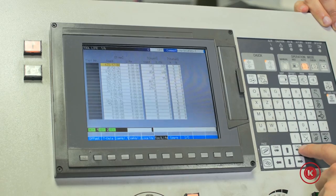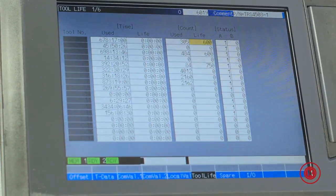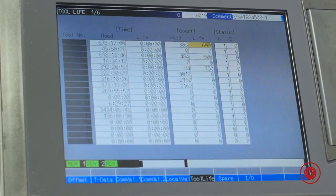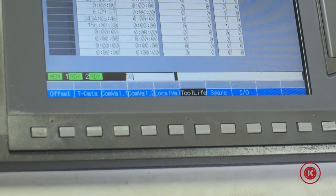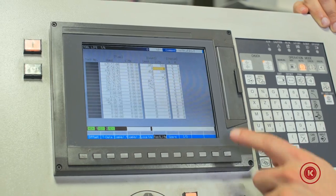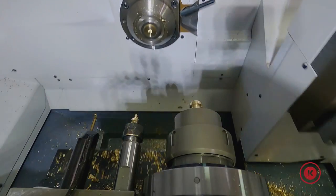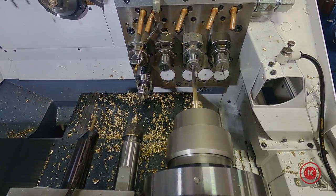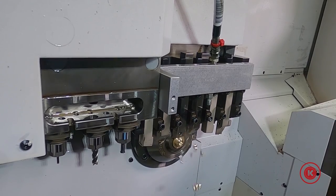At this point, all you have to do is go over to the tool number that you want to turn on and input the anticipated life of that tool that you want to achieve. If there's already something in there and you're making an adjustment, it's a simple input. Once that's turned on, the machine will begin counting your tool life on every cycle it runs, and eventually, once you hit your number of life, it will alarm itself out. It is that simple.